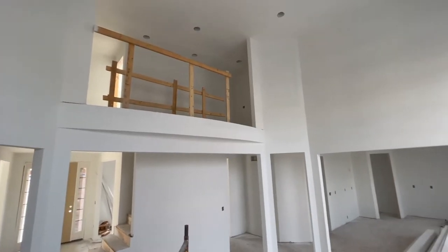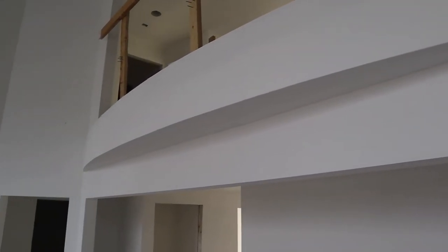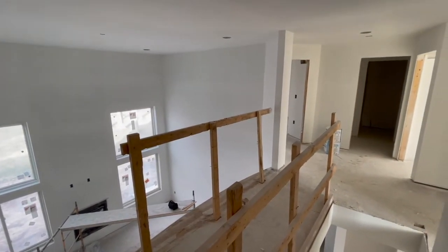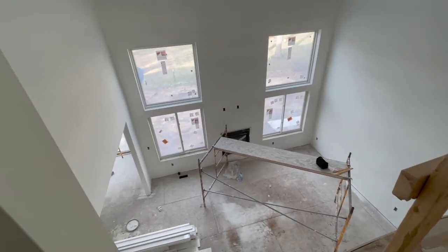Above me here I love this detail we did with the arch on our balcony walking over the living room. This detail just looks fantastic — it looks like something you'd find in a multi-million dollar home. It's not too hard; the drywallers do this kind of stuff all the time. They typically use a thinner drywall like a quarter inch, maybe two layers, and layer it up so they can make the curve without any risk of cracking. I think the image speaks for itself — this is one of those items that people see and say, hey, they took the time and looked at the details.